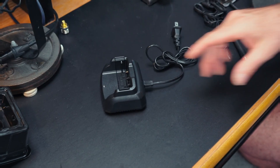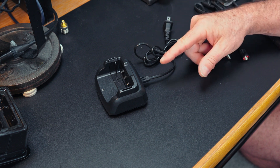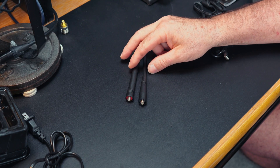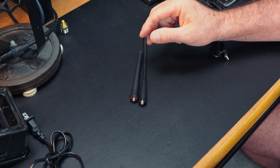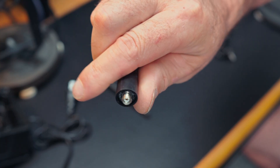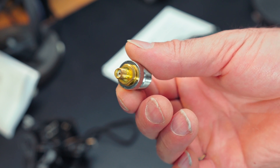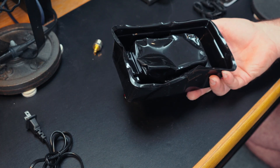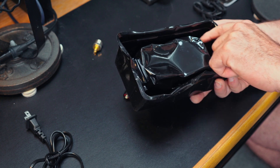What's in the box? First off, we have a desktop charger that plugs directly into the wall with no wall wart. In my opinion, the cord is a little short at only 35 inches long. Next up, we have two antennas: the longer one is for VHF/UHF, and the shorter one is for 2 meters and 220. These antennas use a male SMA, and the female is located in the radio itself. So if you need to adapt this to an SO239 connector, you'll need to get the right connector. The shorter antenna was hiding up inside the box when I first got this.